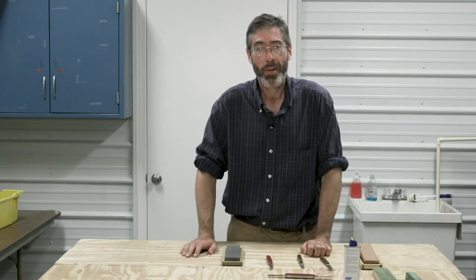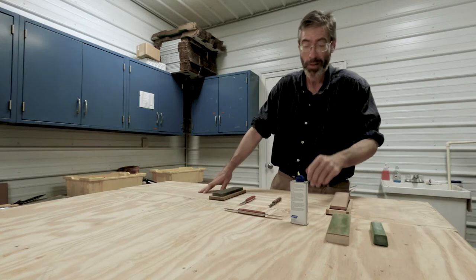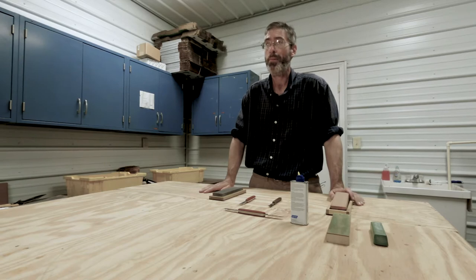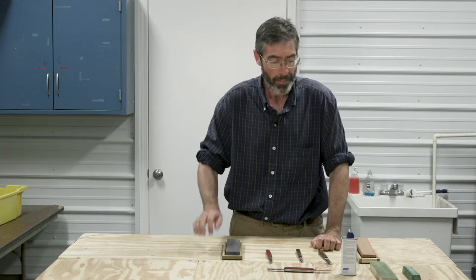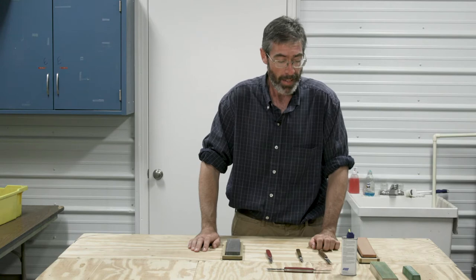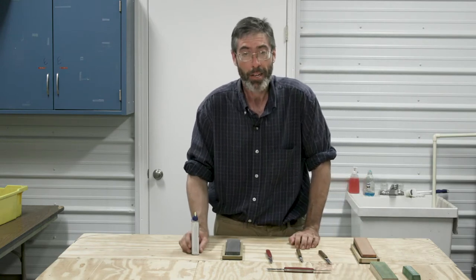In sharpening, because they're sharpened only on one edge, we use stones. You can also use hand-held sharpeners out there, but I like to use the stones. The stones come in a couple of different types: water stones or wet stones, where we use water to lubricate and lift particles of metal off the blade, and oil stones — these oil stones right here are what I'm going to use.